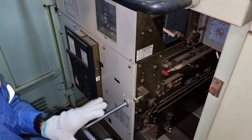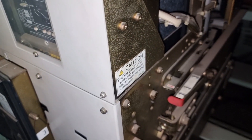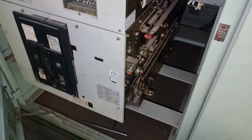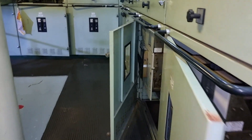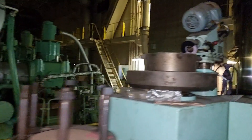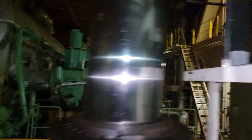We need to bring it up so that we can continue the racking out of the air circuit breaker, and then eventually it will go up again. Just continue the process until we reach the disconnection line. At this state, our air circuit breaker is fully disconnected. We will be racking out all air circuit breakers so that we can fully isolate our main switchboard. Please do not forget to earth the bus bar so that it will be very safe for the crew to work on it. I made a separate video on how to put the vessel under blackout, so I'll just put the link down below.